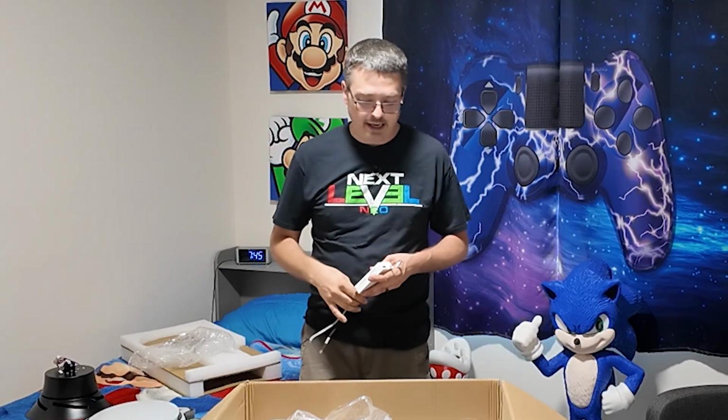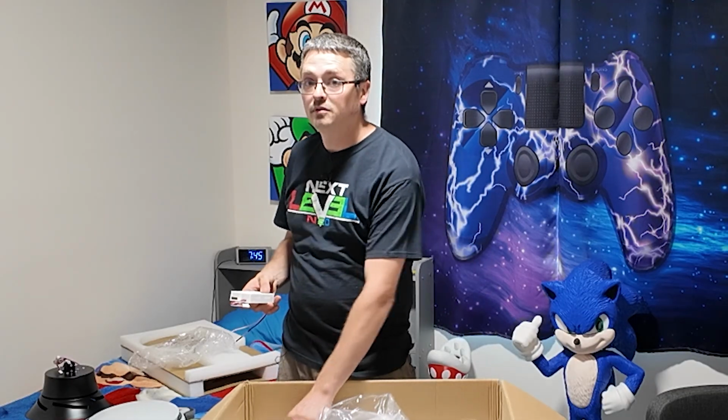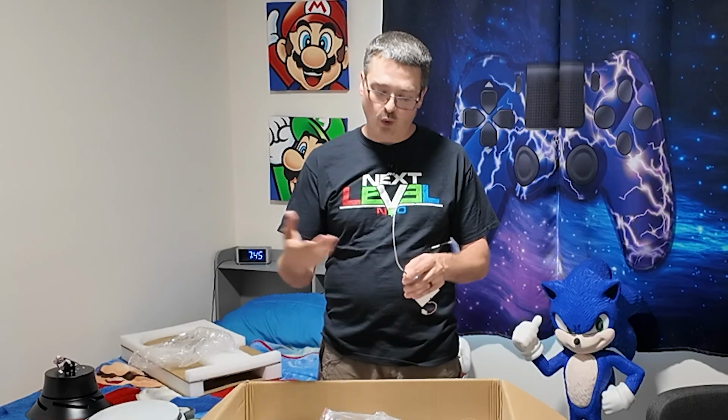In the event you only have one switch, typically you have to flip the switch and the light turns on and the fan, and then you have pull strings that allow you to activate or deactivate the fan or the light or both. And in this case, everything is pretty much going to be controlled with the app or with the remote. So it is just a 2-wire setup here. There is no separate wire for the fan, but you'll just wire that in.